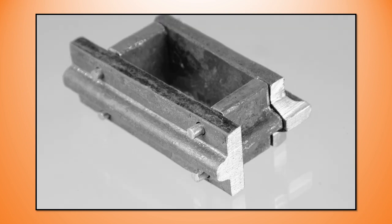Here's my collar with me checking the fit of the tenons. I can always come round and file these top surfaces later if one stands proud of the other, and they do. Once you've got the front or the rear piece drilled to accept the tenon, you're going to mark the perimeter, and then you're going to cut away all the excess material here, and then it's just file work.